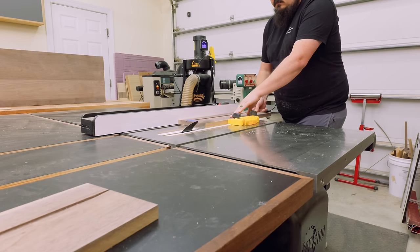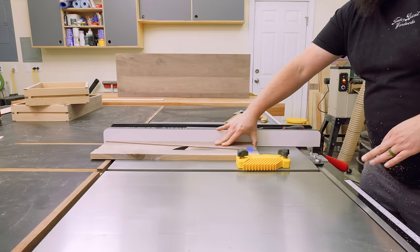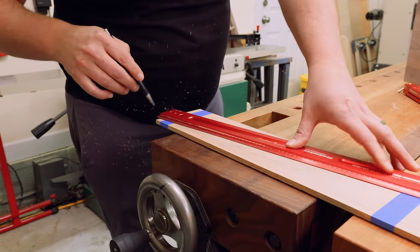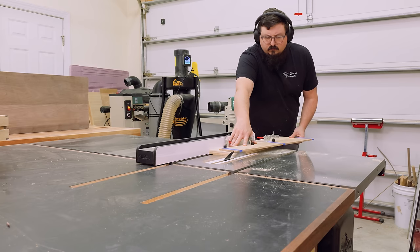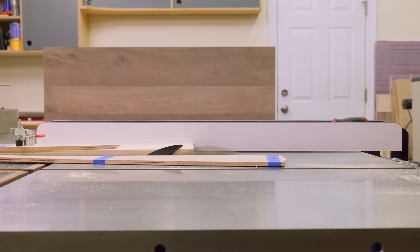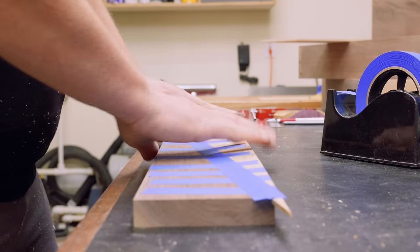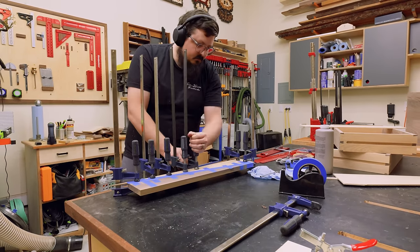As I mentioned, there was a bit of shifting at the CNC, so I'm just trimming both boards so that the inlays are evenly matched, then rotating the pieces to trim the excess from the top. The next step was to trim out my inlays — I whipped up a quick tapering sled and trimmed them down at the table saw. With the inlays all trimmed down, I could go ahead and glue them to the drawer fronts using blue tape and a bunch of clamps. While I do have a vacuum press, I just didn't feel like it was worth all the setup to do two inlays — though after applying 18 clamps to each one, it probably would have been more efficient.